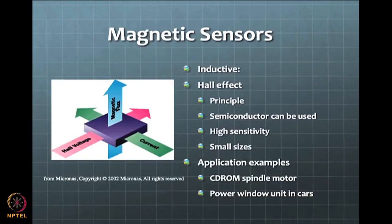Then there are these magnetic sensors which are based on the Hall effect principle. The principle is very simple. You have a semiconductor with current flowing in one direction. So this is the direction of current in the semiconductor. And then you have a magnetic flux applied in a direction perpendicular to it. Because of the flow of current and this perpendicular magnetic field, the electrons will get deflected